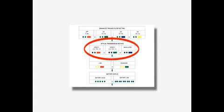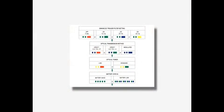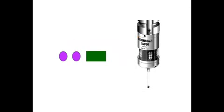The OMP60 has selectable transmission methods. To change the transmission method, deflect the stylus for 1 second. Violet, violet, red. Legacy transmission, start filter off, for use with OMI and OMM with MI12 interfaces. Violet, violet, green. Legacy transmission, start filter on. The start filter on option improves the probe's resistance to light interference on startup, for use with OMI and OMM with MI12 interfaces.